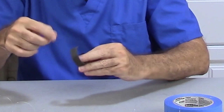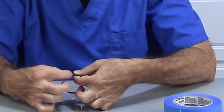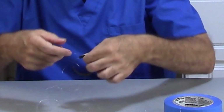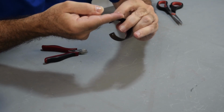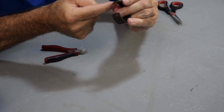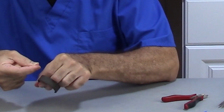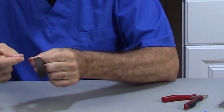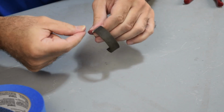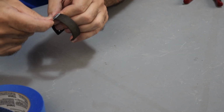Okay, this is a very tedious process. I started by tying off the one end of the coil wire. I went ahead and pulled out about 12 feet and just started wrapping it. I took a couple of breaks because I could only wrap for so long, but this whole process took me about 4 hours. So luckily you don't have to sit here for 4 hours watching me do this. But it is very tedious because you have to keep tension on it at all times. Now when I did take my breaks, I would tape it down to hold the tension.